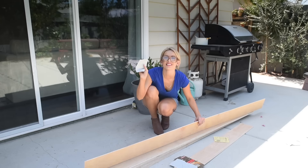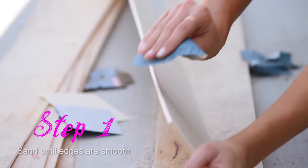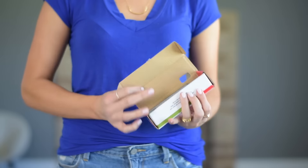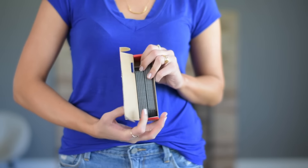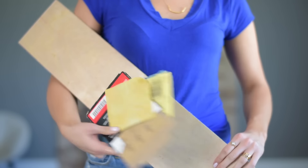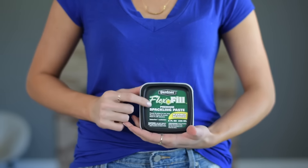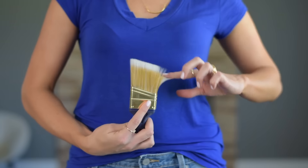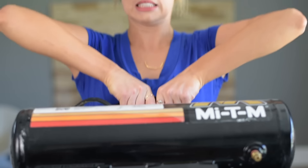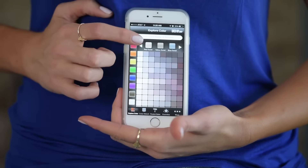Sandpaper, wood — time to start sanding. We are going to show you how to DIY a white wood shiplap wall. Here's what you're going to need: a six-inch roller with three-fourths inch nap, one-and-one-fourth angled 15-gauge nail gun nails, a plastic drop cloth, sandpaper, and six-inch wide planks of plywood, nickels, a spackling knife, spackling paste, a tape measure, a level, an angled paint brush, a nail gun and its compressor, the Behr app to help you select your perfect complementary color, and paint.